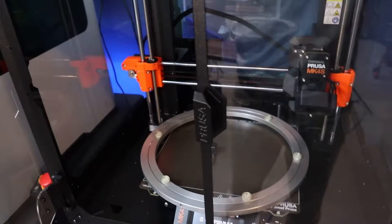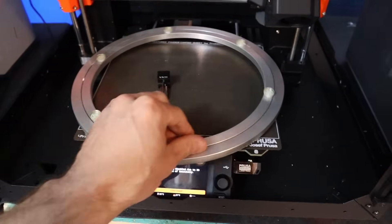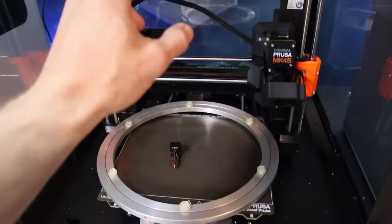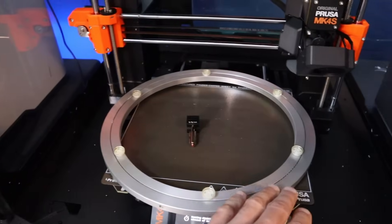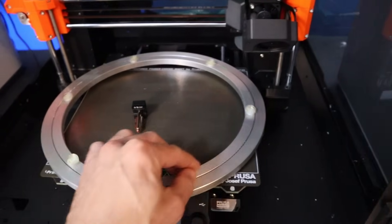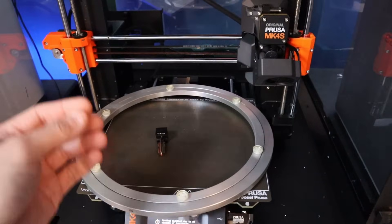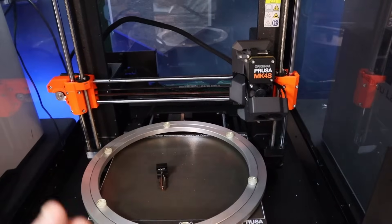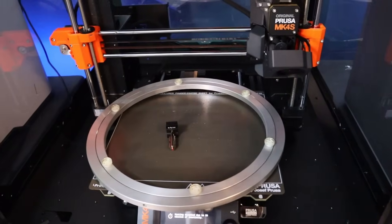With a system that has a bunch of really small tools, somebody could create a tool carousel that sits directly outside of the printer — as long as it was fairly open — and that way it wouldn't take up much space in the printer but would allow us to basically load a ton of different tools. Maybe it can't rotate 360 degrees because of the PTFE tubes up there, but it could rotate 120 degrees or something along those lines. Another idea, taking it even further, would be a conveyor belt system — with some automation involved it could bring the next tool up into place and you could have an entire wall of different tools. So that's another opportunity.